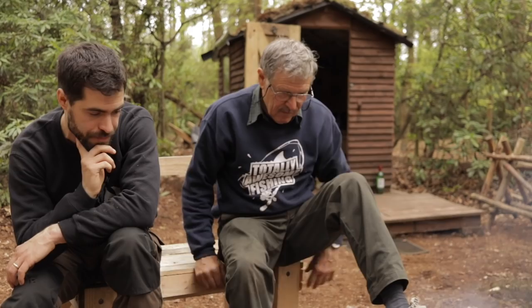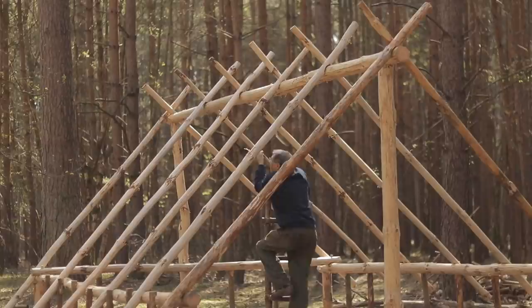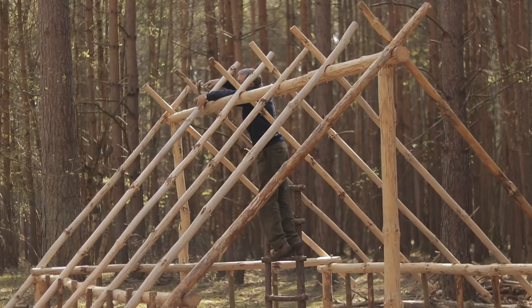Anyway, I think we'll leave that there with you guys. If you are listening and not asleep on your keyboard right now, let us know in the comments section about any of those things that we've been talking about. We still have to think about our roofing material and our walls. If you have any suggestions, let us know, although we already know really what we want to do. Another point is we put the roof rafters on early. We should be weaving the walls first, claying the walls, and then doing the roof. Otherwise now we've got the rafters in the way and it's going to be difficult to weave. But we did realise that.